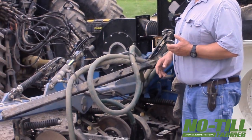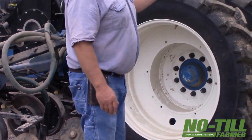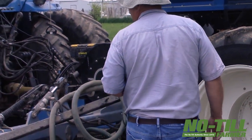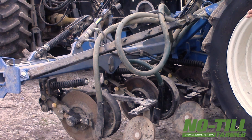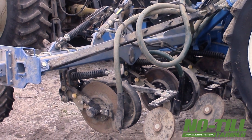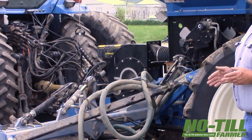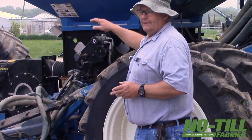One of the things I like about it is I've quit putting almost all my fertilizer down with this operation. I am eliminating the fertilizer I was putting down the row — liquid fertilizer down the row. So we've got openers and sealers. The planter mounts on the rear — it's a three-point mounted planter. We've got the openers running two-by-two from the seed as it goes down the furrow. When I want to side dress, I loosen up the units and move them on the toolbar to run down between the rows. We also change some of the metering gates for changing it back and forth that way.